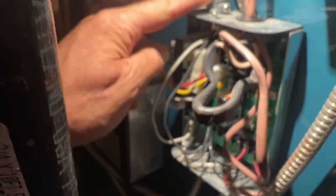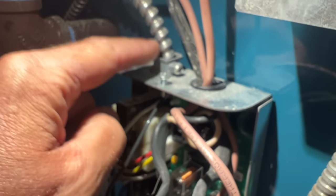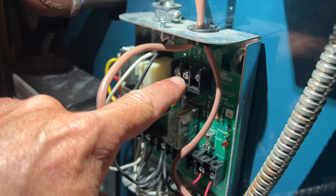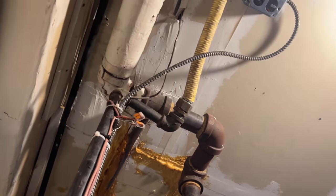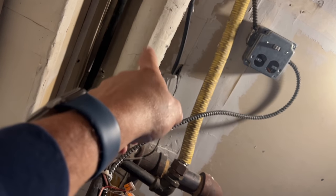We're going to start by removing some of these wires. They brought in the line voltage for the circulator to the top. We have another line voltage from the power source at the bottom. The thermostat wire - I don't like this, it's cluttering everything up. Start disconnecting the wire. I cut back TT - Peter's just going to cut that out of the way. Let's get rid of that. We'll get some two-wire thermostat wire, splice it right there - red and white - get a couple of Wagos, zip-tie it down along here, and put it onto the new box.